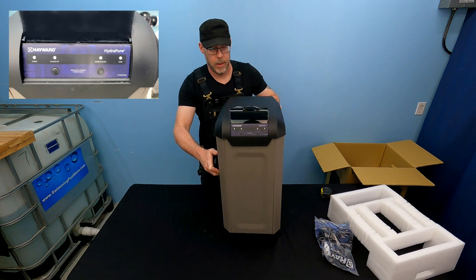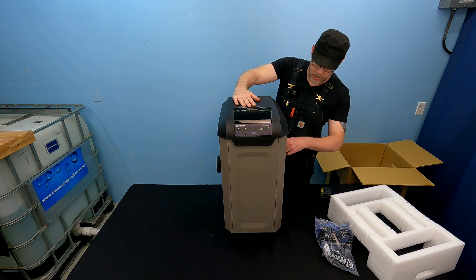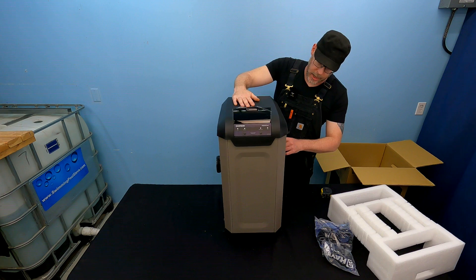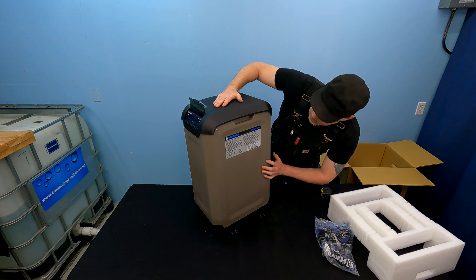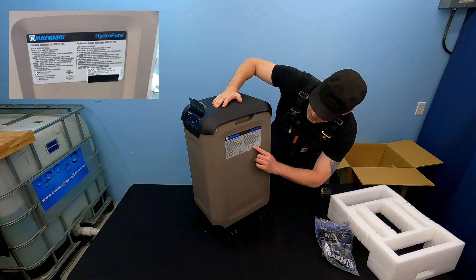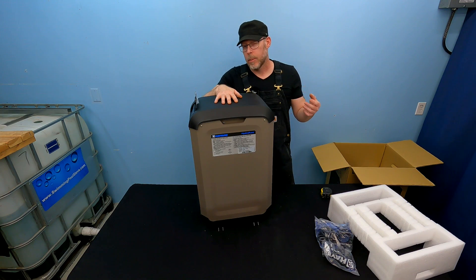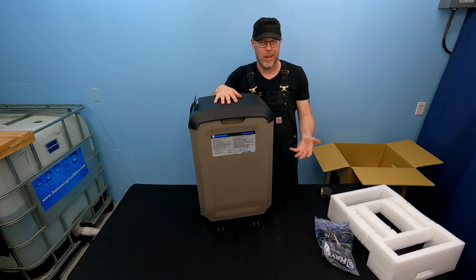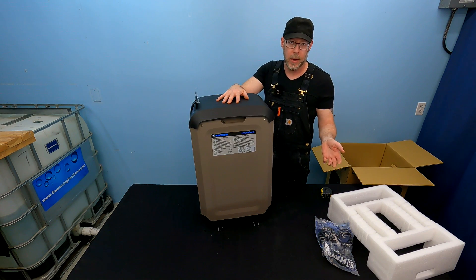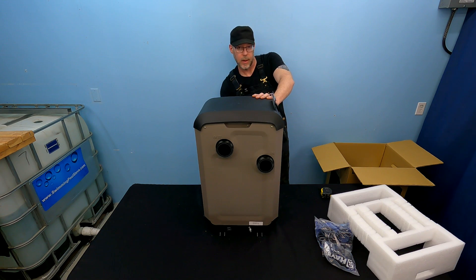The interface is facing this way. It's 115 volts or 240 volt power — important to know you have that option. I'm kind of an electrical guy, so one of the things I look at right away is the amperage. At 120 volts it's 1.26 amps; at 240 volts, 0.63 amps. I was wondering how much power this thing would use since I have to allot for it in my plan — and it uses a tiny amount, like a light bulb. I assumed it would draw more, but it comes with a bonding lug on the back and uses 151 watts total.